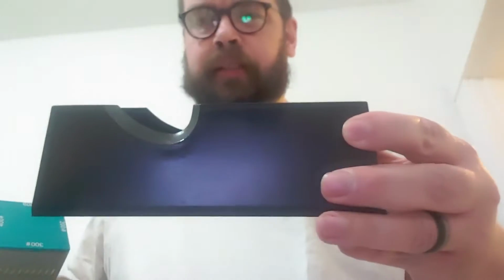What you're going to need, good sharpening stone. I prefer a multi-grit stone. You can get the Arkansas and different wet stones that are fine on one side, coarse on the other. I don't like them as much, but they'll certainly work. What I like is this, and it's really cheap, this Diamond Life. It's from Harbor Freight. It's got a stand.